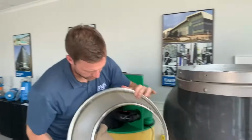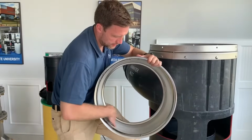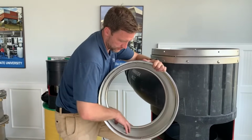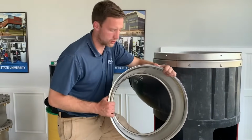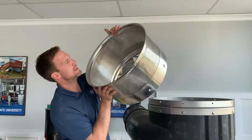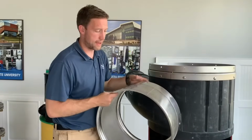We have some pictures online you can see as well on how to clean the unit, but typically some type of simple green or some type of solution to clean off the mold. To get that off the filter surface itself, it will help to spray that on, and a brush as well to clean the pores out. What you want to do is make sure you can see through the filter screen. You can actually pull it up in the light and look through and see that the pores are clean. Because if they're not clean, then the water will not pass through the filter and go into your tank.